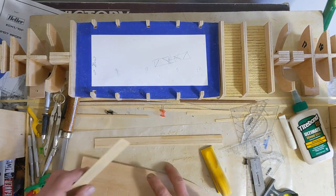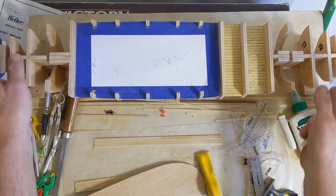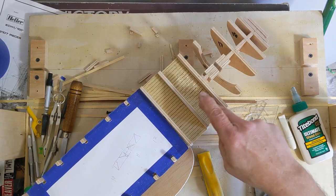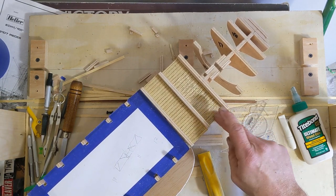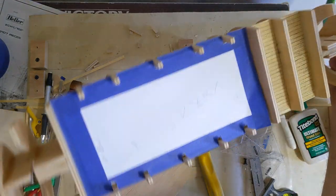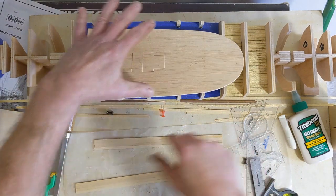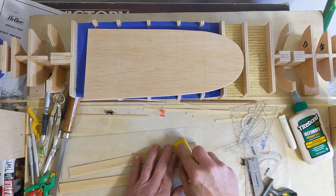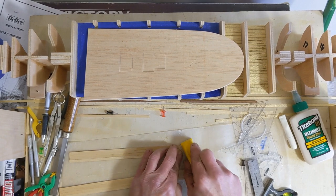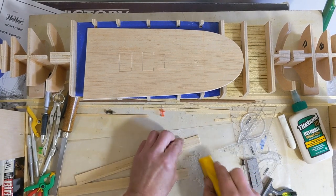Well, pre-drill, and what I'll do is I'll go get my teak oil. I'm going to show you that video about the teak oil. That's what the decks are made out of here, or stained with. I bought four or five different stains and tried it, and a buddy of mine had told me he uses teak oil. I'd never used it before, and I tried it, and I really liked the way it looked, so that's what we're going to use, teak oil on all the plankings. So I'll give this a good sand and get it down. This is 80 grit, just to hog it down a little bit, and then I'll get 220, probably some 300, 3-something, and then drop it down to 600, just like I did the lower decks.